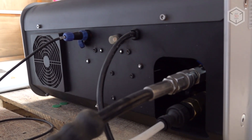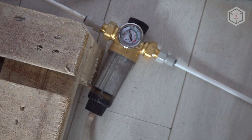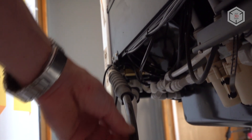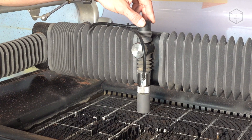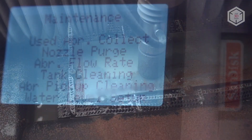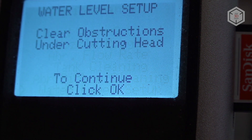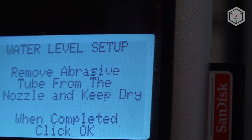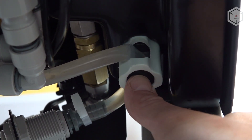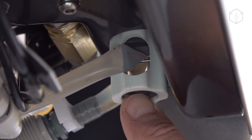The pump unit is connected to a water supply system with a stable pressure of at least 2 atmospheres, and creates a working pressure of 320 bar, or 314 atmospheres. The high-pressure line is connected to the solenoid valve at the rear of the body with a reinforced rigid hose, while a thinner hose delivers high pressure to the nozzle of the cutting head. Water consumption is low, with pressure being the decisive factor. The tub under the bed must be filled with water during operation — either manually or through the nozzle of the cutting head with disconnected abrasive supply, with the first option being much faster. The water level is regulated automatically by sensors and drained through an electromagnetic pinch valve that squeezes a silicone hose with a metal clip.